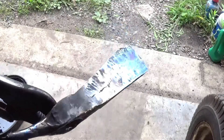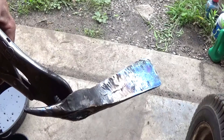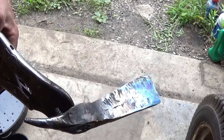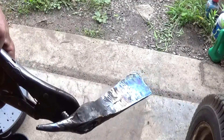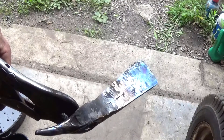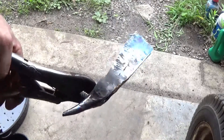Same thing with the bird beak on the back. I'll let this air cool - this is probably one of the most dangerous states for metal. Most people know red metal is hot, but when you see something blue like this you won't suspect it's hot. This is enough to give you second and third degree burns. After this I'll let it just air cool, then start to grind on it. I'll keep a little pot of water there so every time I grind I drop it in - I don't want to lose the temper.